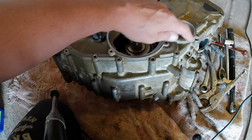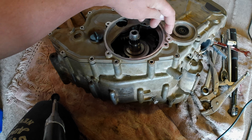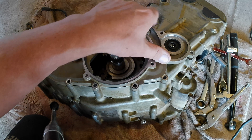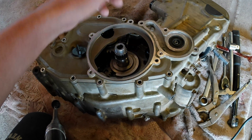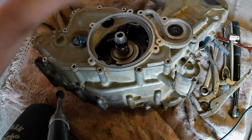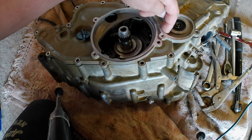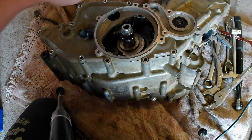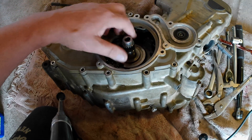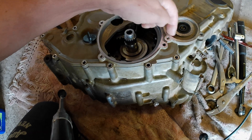Undo all of your bolts around your cover. Take note that inside the water pump — take the top of your water pump off, remove your centrifugal pump disc. There's a little screw in the middle, and there's an extra screw that sits inside here. When I first undid all these I spotted it but didn't think it was needed to take this cover off, but it does. So you've got a screw just here, it was black in colour.